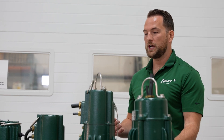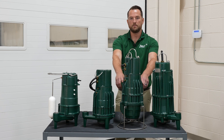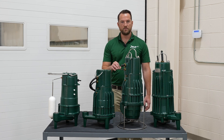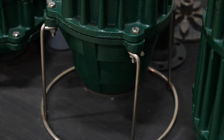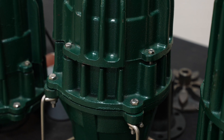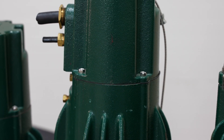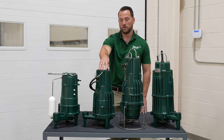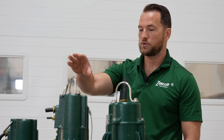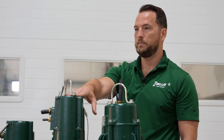The 820 is great for commercial applications where you need more flow and more pressure. For pressure sewer applications where pressures and flows fluctuate, this is a great solution. We also offer a progressing cavity model — our 810 and 815 — in both one horsepower and two horsepower options. The two horsepower option produces 240 feet, or a little over 100 psi of pressure, making it ideal for very high pressure applications. It produces relatively low but predictable flow. For strictly residential-like commercial applications with lower flows, this is generally the better solution for pressure sewer; for higher flow needs, you'd go back to the centrifugal.